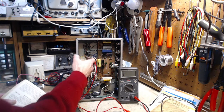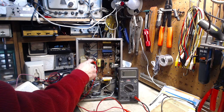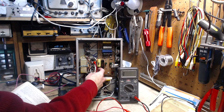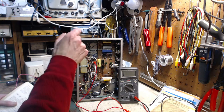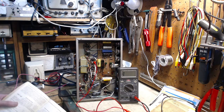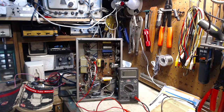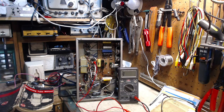So that tells me that this tube develops an inverted signal — a signal that's 180 degrees out of phase with the incoming signal. It then sends the in-phase signal to one capacitor and the out-of-phase signal to the other capacitor, and the capacitors feed them onto the two grids of the push-pull. Nothing unusual about that — everything's quite normal. The reason I'm concerned is because this is where the high voltage DC is that needs to be blocked by the capacitors. It seems to be blocked. Unless I'm putting brand new defective capacitors in there — there's just no chance of that really. So I'm really stuck. Where is this voltage coming from that's building up on the grids of the output tubes? The mystery continues here.